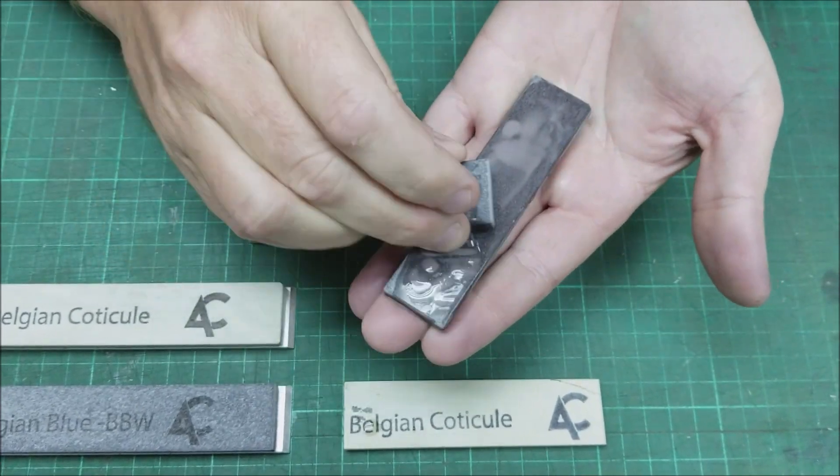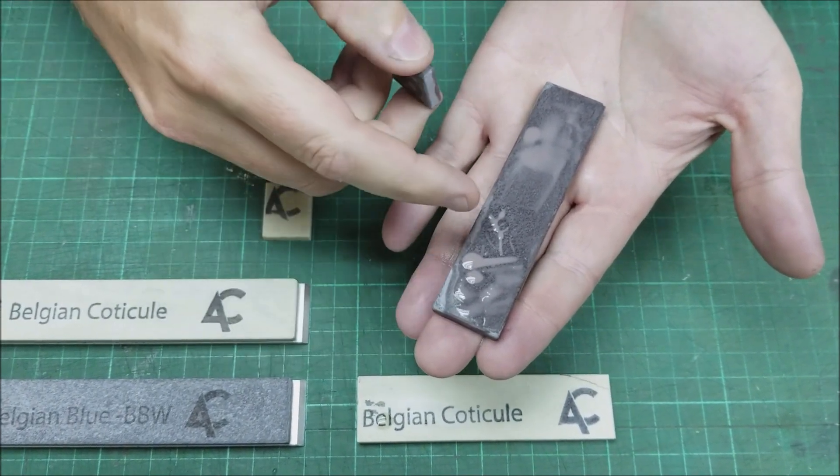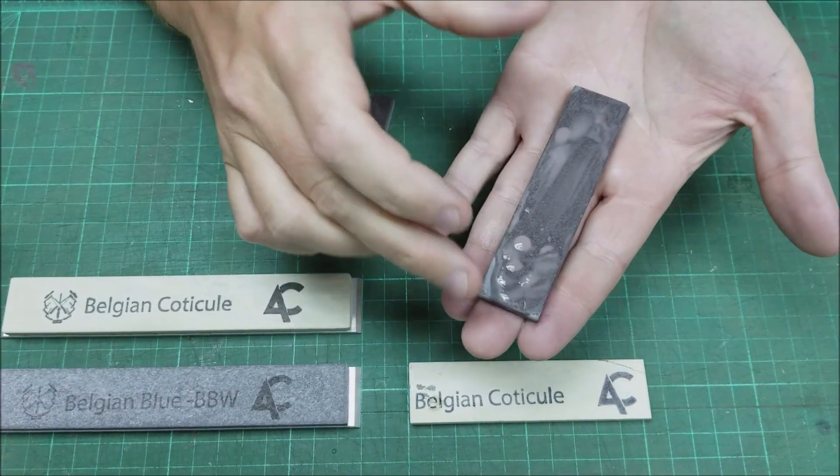It's going to be a purpley color, so you want to utilize that. As you continue sharpening, add little bits of water at a time — literally like drops — until it dilutes, and then you'll finish on just a clean stone, which is about 4,000 grit.